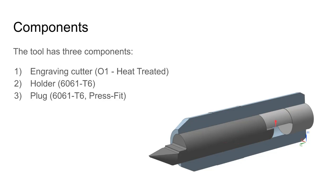The function of this plug is to stop the actual cutter a certain distance into the holder and it also prevents rotation. This allows the cutter to slide in, and you can reverse the cutter so the pointy end goes up into the recess — the back end is less pointy and a little less dangerous. Don't try to take it on an airplane — TSA has confiscated several of these from former students.